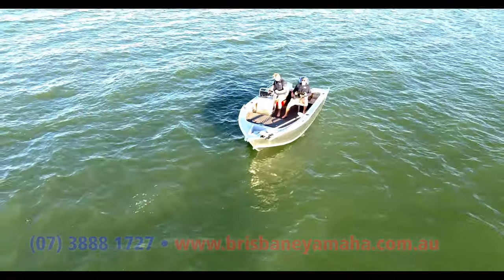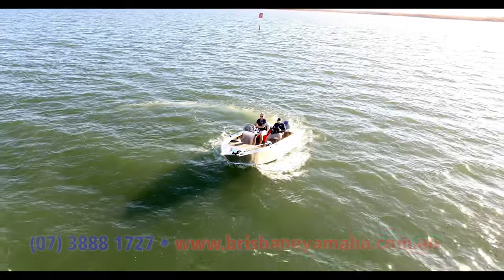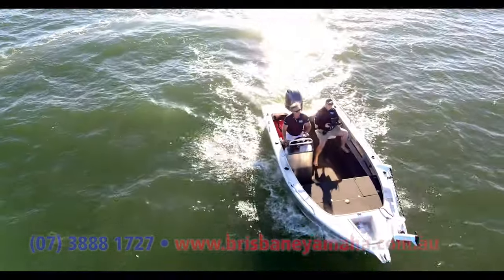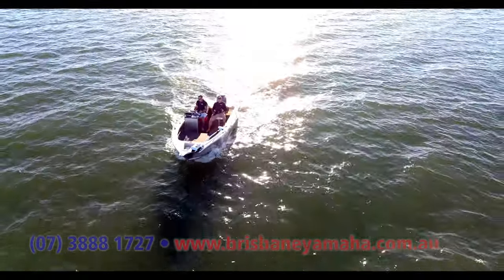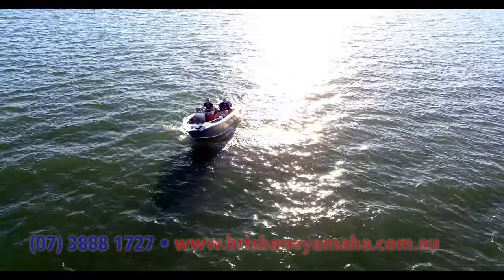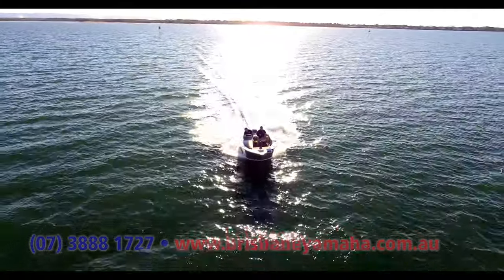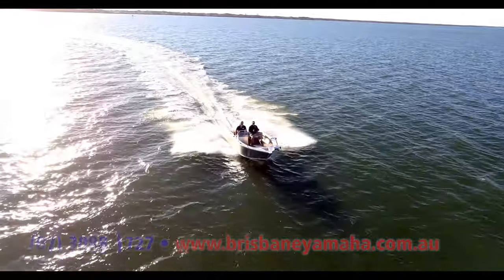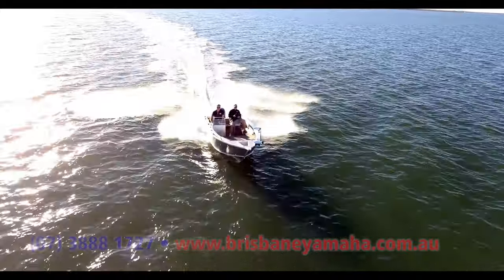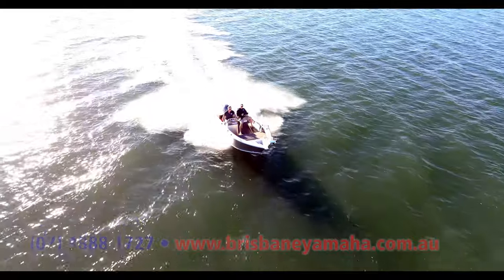So we'll trim it down. I've got the sounder, I've got my phone down here for speed. This is a sold boat — it's going to Harvey Bay. There's no one in Harvey Bay you can buy a boat off, so you come down to Brisbane, you save money, you get a boat. We've got the 90 horsepower on the 490 and I'll take off. Straight away it just bounces and jumps out of the water. Going along at 39, using 12.3 litres an hour. We're doing 36 k's at 3.8 revs. We're doing 5.5 revs and 55 — it basically does a kilometre per rev.